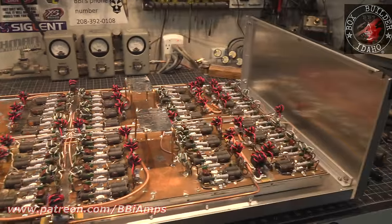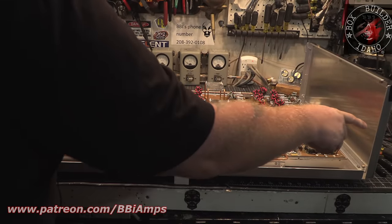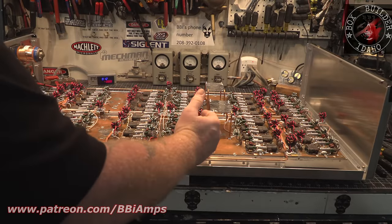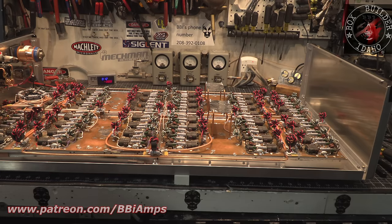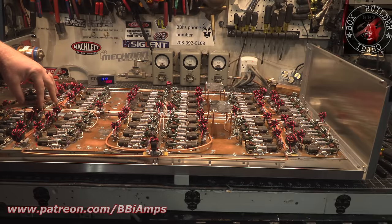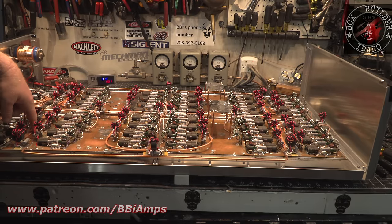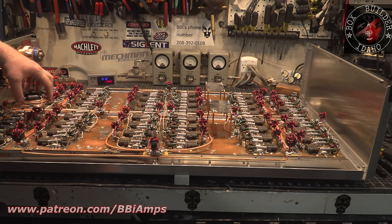So what I could have done in the very beginning with this entire process is I could have made this about 6 inches longer, slid the whole amp board forward another 6 inches, and then had my combiner stages sitting back here in a corner in the back, which is what I should have done. So we're trading off the fact that we have to have it elevated, which in its own way brings problems. You have to bring this board to the same electrical potential as this board for this to really work properly. And we have a coax storage issue, which we were able to address here.